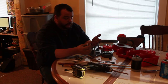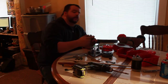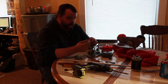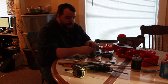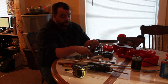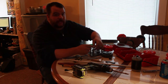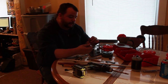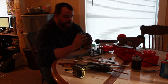I really like the idea of washers. On my other one, it was pushing on the collars themselves, which was not good, and it was not making the wheel spin very well. So this one, I'll try it first with the washer, just because there's more surface area touching this plate here. So it distributes the weight and it won't slide as much, and you won't lose tension in your chain. That's my theory. So the gear is going to go down, slides right in.